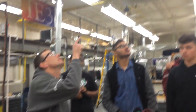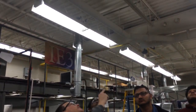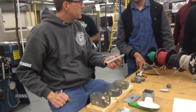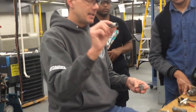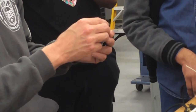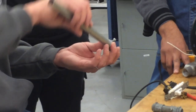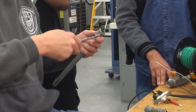If you look above you, you can see all the conduit for the power and lights, and they've got a strap or clamp every six feet or so. For a really long run you'd have clamps holding the pipe in place, but for you guys you're making short runs — a little two-inch piece of EMT. If you cut it and it gets out of round, it won't work — you've got to keep it perfectly round when clamping it in a vice. The set screw has to be backed out enough to slide the conduit in, then lock it in with the set screw — a little different than the Romex connector.